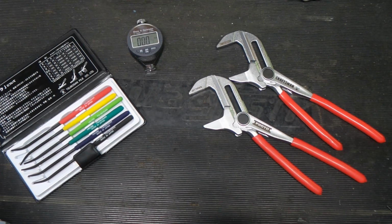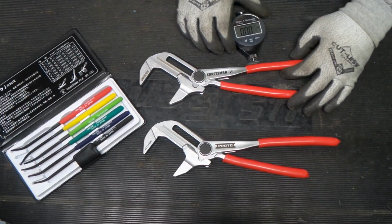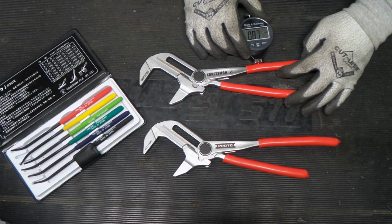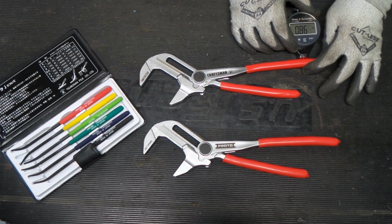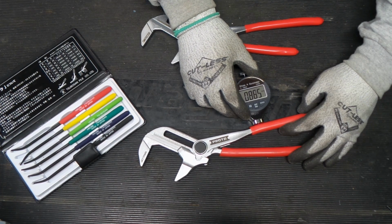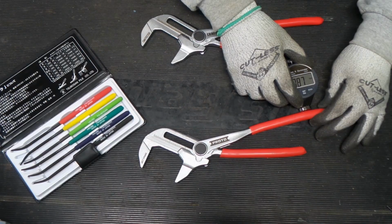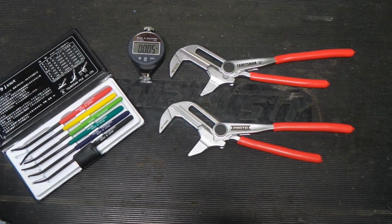And next up, we're going to use our Shore A meter here, and we're going to check some points on the rubber. Now we have to be as perpendicular and flush as possible, so let's see what we get here. About an 88, and here's a good spot, about an 86. Let's go to this one. About an 85 and an 87. So I think I'm happy with calling that an 86 and a 50 to 55.